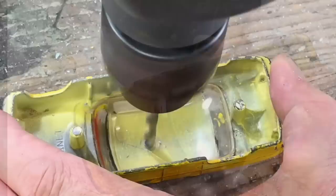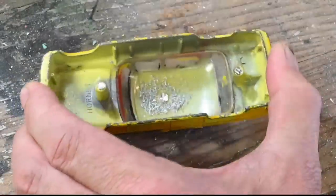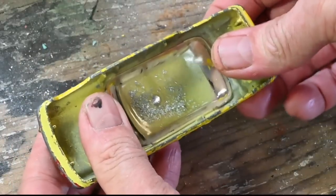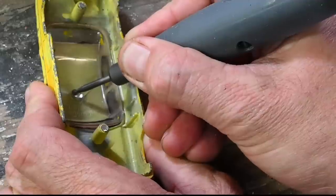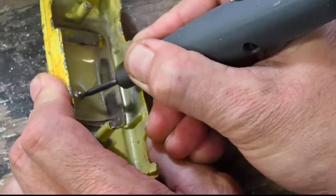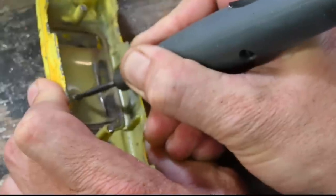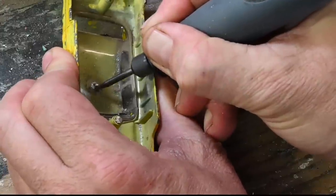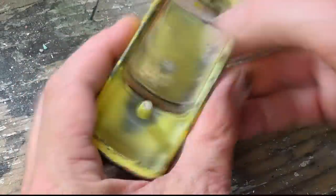The windscreen does have a crack in it — it's only across the top, thankfully you can't see it from the outside. I'll drill out the tab that's holding it in. Now I'm going to try and pop out the windscreen but it's not coming out. I don't really want to drill it anymore so I'm moving on to a round burr on my Dremel, speeding it up and trying to take off the edges of the post. But it's just not happening — you can see how many times I had to go back in with the Dremel.